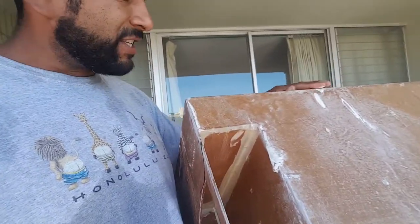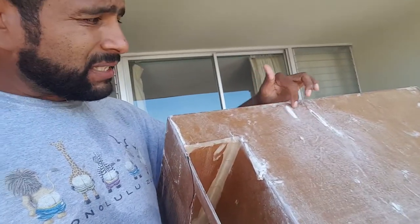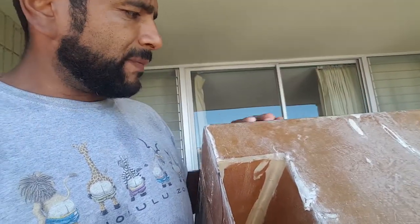Hey guys, I'm still working on the bench. I just put some fiberglass at the bottom, but I got kind of lazy and irritated because it was hot — the sun was right in my face — so the solvent was getting hard extra fast. I made a bunch of mistakes; these are bubbles. Now that it's cooled off a little bit I'm gonna take my time, sand all this stuff down, and tomorrow hopefully do one more sanding, one more layer of resin to even it all out, another sanding, and then it'll be ready for paint.